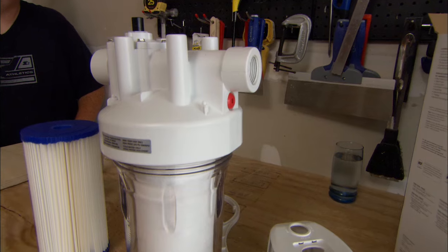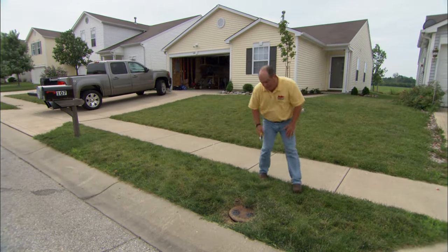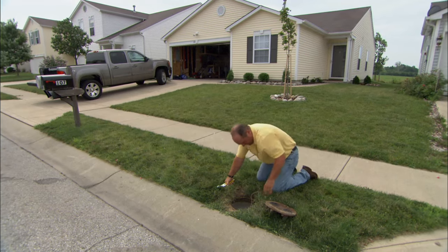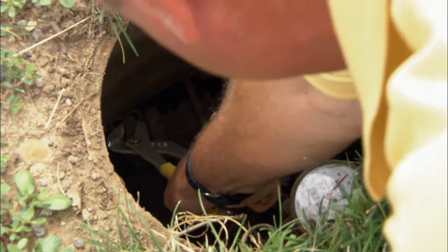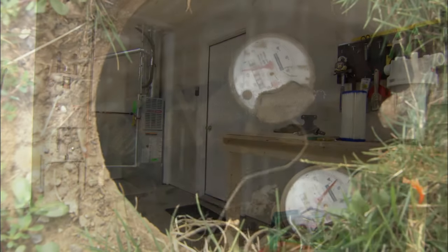For your job, the best place to turn the water off is out in the street. There's a meter pit, and down inside there are two meters — one for this house and one for the neighbor's house. It also has a shutoff valve called a curb cock. You just have to turn that off.